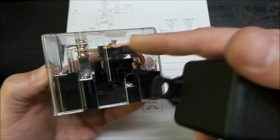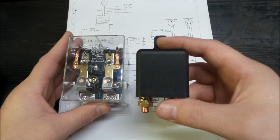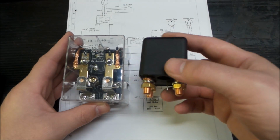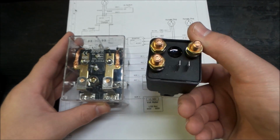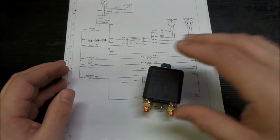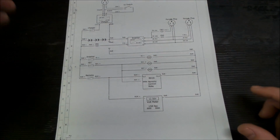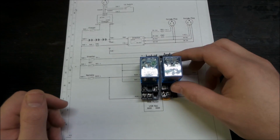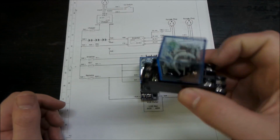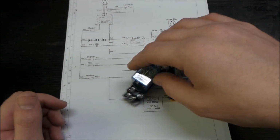You can see the double throw there, normally closed, normally open. And this is basically the same thing, but this is rated 250 amps. So this is smaller, rated for higher current. I don't know that I trust 250 amps on it, but I think this is the route I'm going to go, just to give it a go, see how it works. So we have the relay to turn on and off the inverter, and then we have some typical ice cube relays here, 120 volt contact rated, and 12 volt coils, just DIN rail mount.